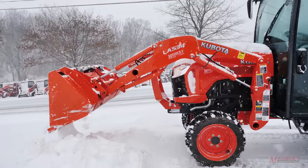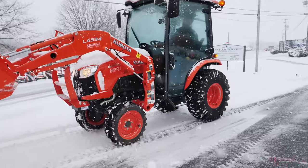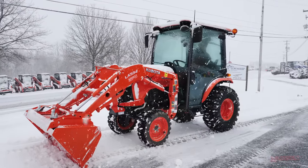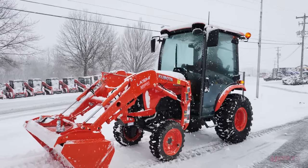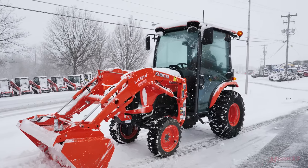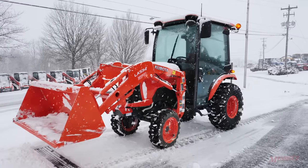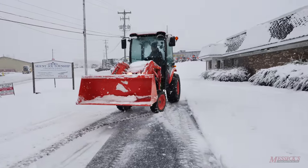We're just going to drive forward and sweep right off the side. You do not want to push with your bucket curled the entire way forward. If you have those hydraulic cylinders extended the whole way with the bucket tipped all the way around, if you catch something — a manhole cover or a curb — it puts a lot of strain onto those loader bucket cylinders. So you never want to be pushing against stuff with your bucket curled down the entire way.